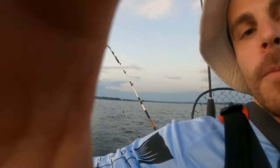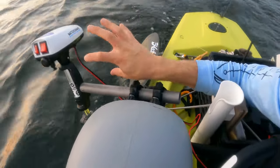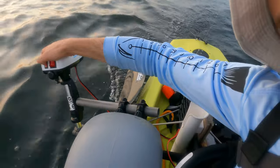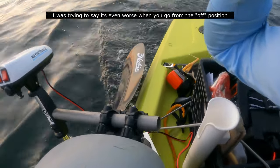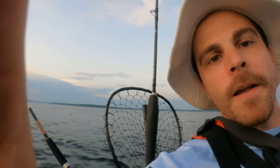It does jerk. I will say this bracket isn't the best — it does kind of rack a little bit once you turn it on. Other than that, it's done pretty good so far. I got a 35 amp-hour battery and I think it draws somewhere around 9 amps on low and 20 amps on high. So if I get two hours on high, that's pretty good, but I could probably get four hours on low. So I'm going to keep it mostly on low.